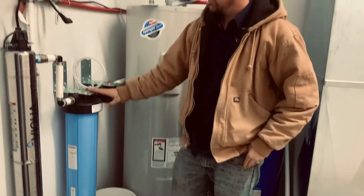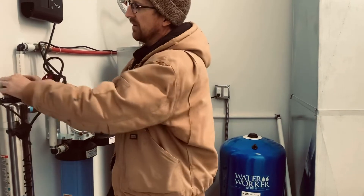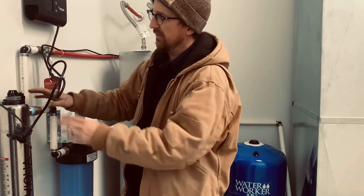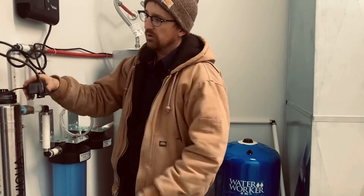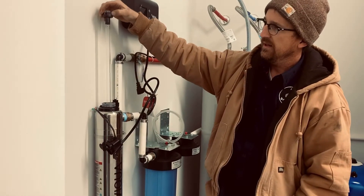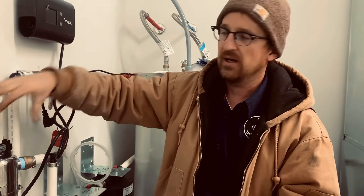When you're on a six-month filter schedule, it's a good idea to also service the UV system at the same time. You'll wait every year to replace the lamp, but every six months it's a good idea to service the quartz sleeve of the UV system. Make sure the power is off and the lamp has had a chance to cool down. Then remove the female electrical plug on top of the UV lamp, unthread the lamp from the system, and the lamp just lifts up. When replacing a new lamp, it's the same process — pull the old lamp out, put the new lamp in, and thread it on to replace the electrical connection.